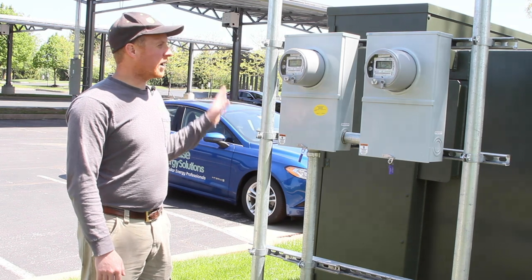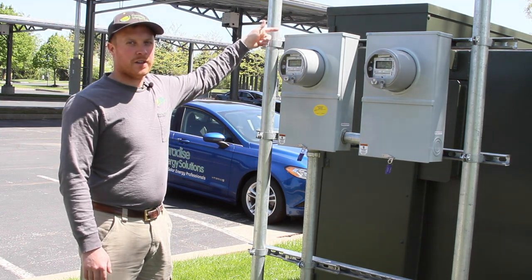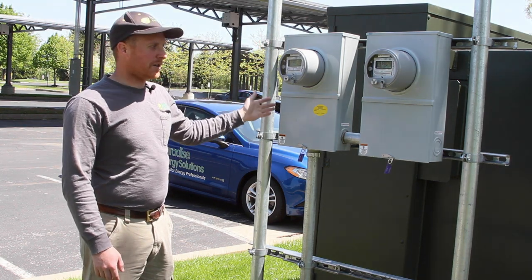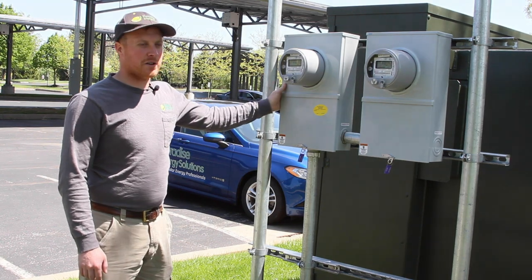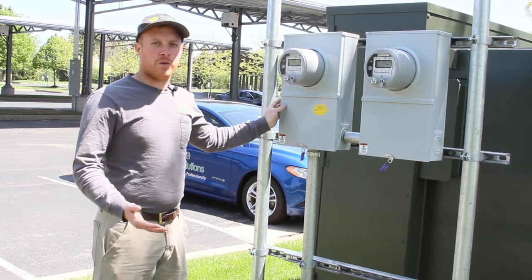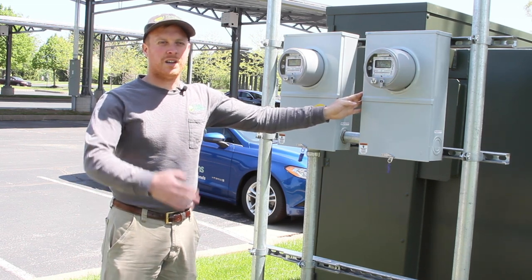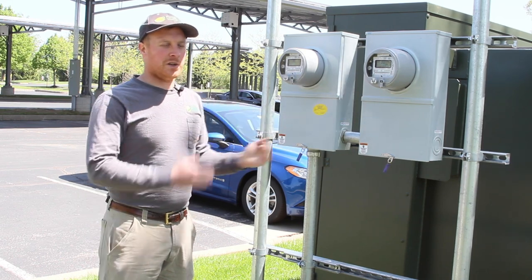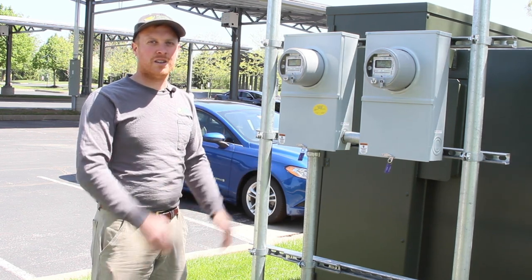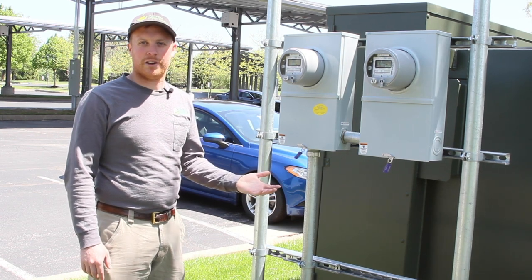Let's wrap up out front here — this is where everything comes together. The electricity combined in the giant combiner cabinets behind us feeds into this utility transformer. We had to bump up the transformer one size to accommodate the larger output of the solar power. That's now monitored by these two new utility meters: the in meter, which monitors all the building's usage like any traditional building so the customer can be billed accordingly, and then the solar out meter, which monitors any time the solar is producing more energy than the building is consuming — that extra power is pushed back into the grid. Between the two, the utility and the customer can settle up on billing, whether the customer is receiving a credit or a bill for excess usage. And now we're all done — it's time to let the customer start watching their investment work for them and watching their utility bills disappear.